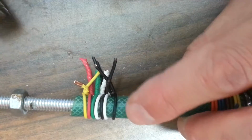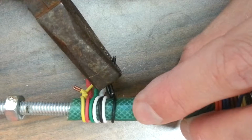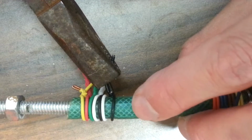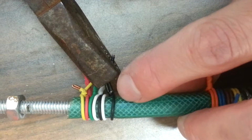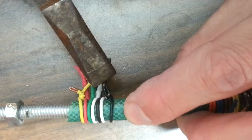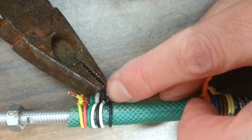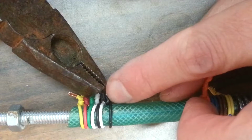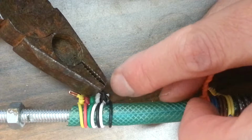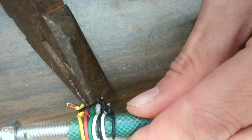At this point, grab higher. Okay. This is going to just constrict the current tension you have by pulling the wires tighter together. Make sure both wires are twisted together, that one wire is just not twisting around another straight wire, because that'll lose the gripping power. Okay, and just twist.